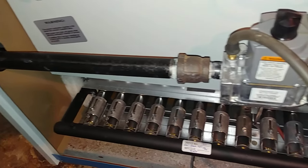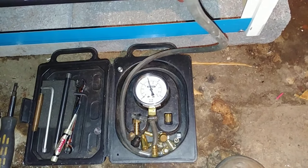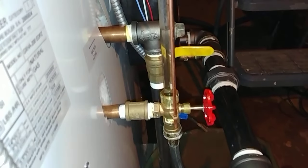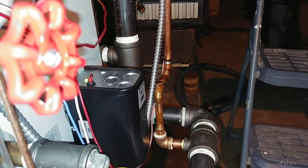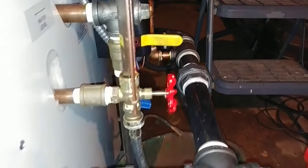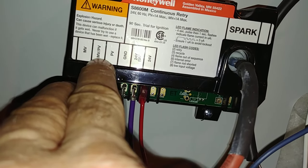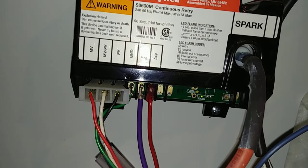So that's our gas control cock there; the gas meter is some feet away. Now we're going to go ahead and turn on the boiler. It'll take a few minutes while it does its self-check. The damper is opening, and it's going to send power through the pilot valve, which will be proven by the flame sensor, and then the main valve will come on.